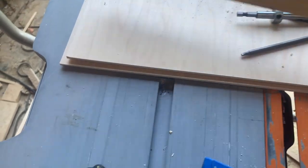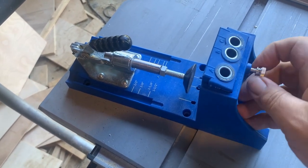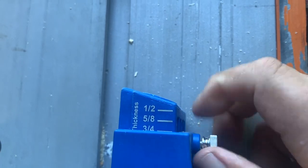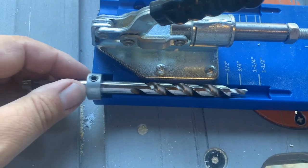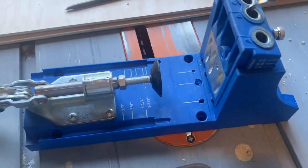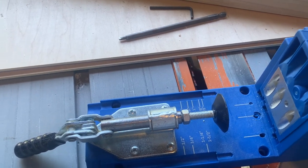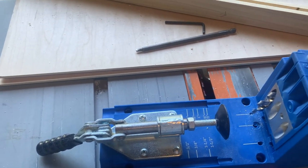There are a couple of things to do to set up your Kreg jig for the piece of wood you're working with. The wood we've got here is three-quarter inch, so everything is set to three-quarters of an inch. The guide at the top moves up and down — you unscrew the thumb latch, set your guide to three-quarters of an inch. This thumbscrew won't go in unless it's actually lined up correctly for three-quarters. Then down here you'll notice marks — set for three-quarters of an inch. I like to make mine just a little shallow of the three-quarter-inch line. The important thing is that when you drill down through, you don't want the bit to break through the face of the wood — that's a mistake. So that sets up my guide perfectly.